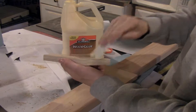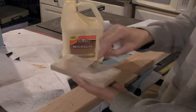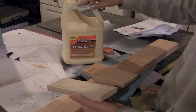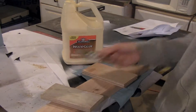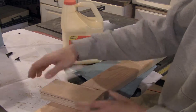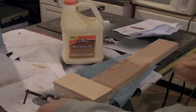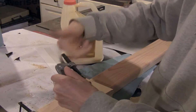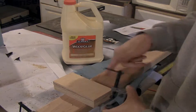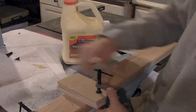I'm using good old wood glue to glue these two pieces of plywood together. Apply glue to one side and cover it completely. I like to use an old gift card as a spreader — it's cheap and easy. Then use a couple of C-clamps to make sure you get a nice bond.